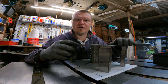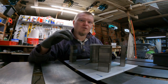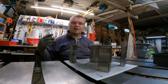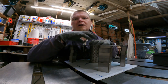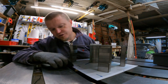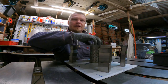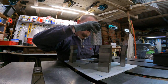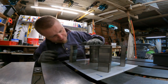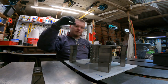But one of the things I figured out is that if I make this central chamber on the table and then try to put it in, then I can weld from each side when it's in the box. I'm hoping that it'll become clear later, but the first thing that I want to do is weld this one with 130 millimeter space and then the perforated tube in here. And yeah, I also want to lift it up maybe 5 millimeters so that the tube sticks out.